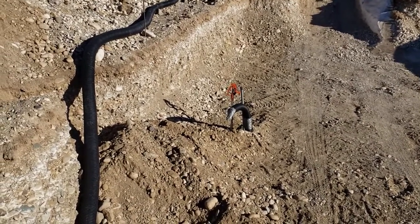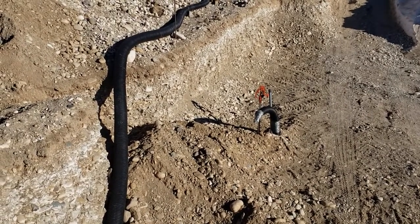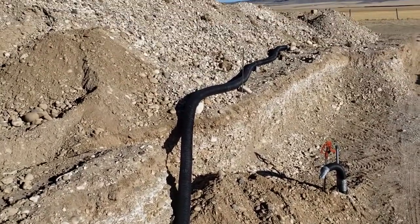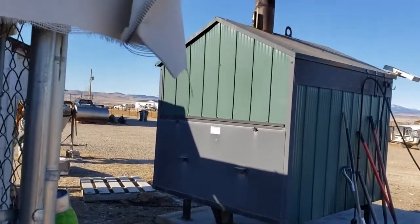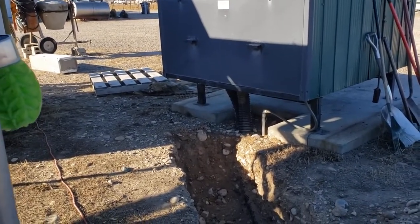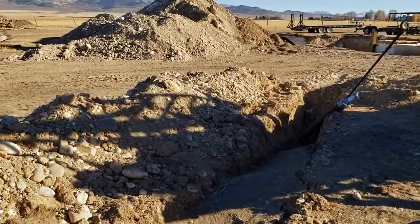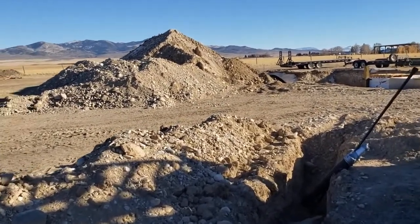You'll notice the big four-inch black corrugated line that is going to be a boiler circuit from our outside wood boiler. That's two two-inch flex lines that are insulated and buried in the ground, trenched over — you can see it stubbed up there. You can see two other black corrugated lines coming up at the bottom. One is feeding our house now — we feed our house, our potable hot water, and our shop. The boiler has enough BTU capacity to handle that, and we also have the upcoming hydronic solar panels.